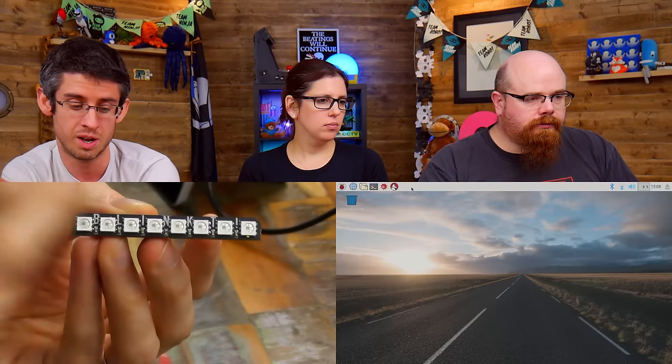So the important thing about the Blinkt is that it's got... let's get it on the... Where is it? There. Woo-hoo. Cool. So the important thing about the Blinkt is you have to have it plugged in the correct way up. Now, we've designed it in such a way that nothing bad will happen if you plug it in the other way up. But the way to tell if it's the correct way up is if you hold your Raspberry Pi with the Raspberry logo the correct way up facing you, and then you get your Blinkt and look at the writing on the Blinkt, then that should also be the right way up.